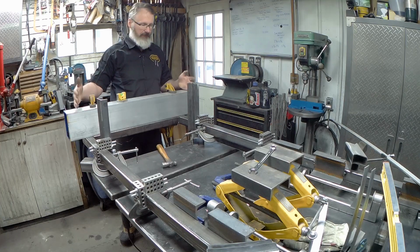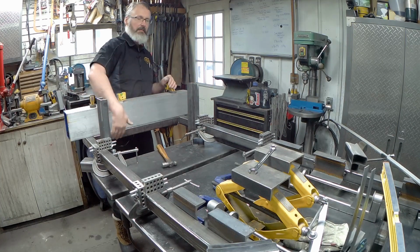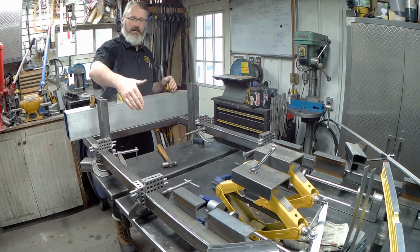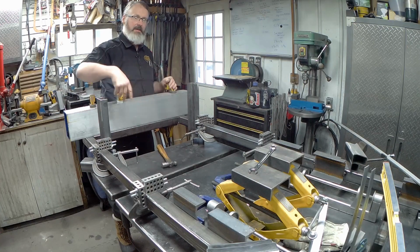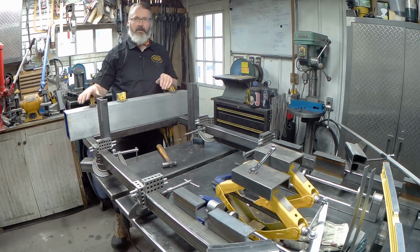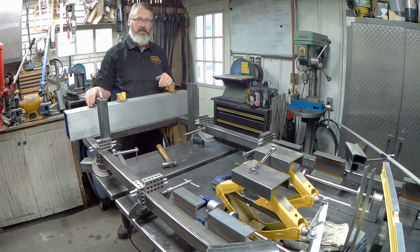So I've squared everything. This is my reference plane. I found it very difficult again to be measuring to the bottom of the jig here, because it doesn't have a square corner like the aluminum does, and everything seems to be in the way. That's where the parts are. So I'm trying to measure the pickup points for the lower control arm. I'm not particularly concerned with some of the rest of the pieces.